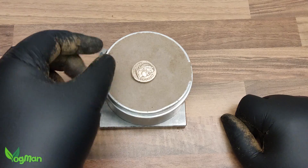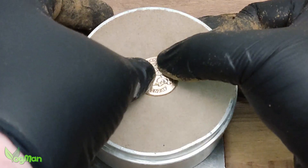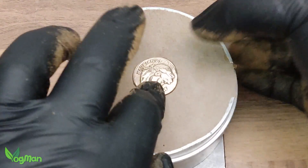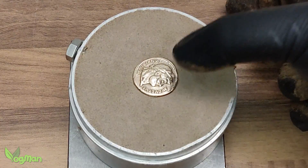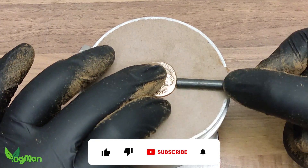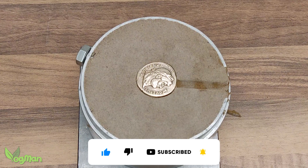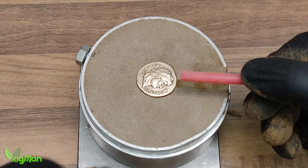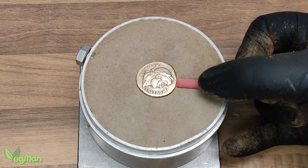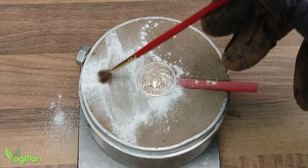Take the pattern and press it firmly and squarely into the sand. Don't rock it side to side — keep it flat and even. You're trying to push it in around half its depth, so don't go mad. Taking note of where the access hole is in the flask, I began using an ordinary drill bit to push down what will become the feed sprue, and again I'm only trying to go halfway. This is a 6mm wax sprue, but anything of a similar size and shape will work. For now I'll leave this in place.